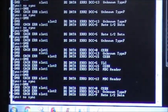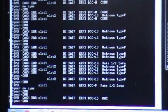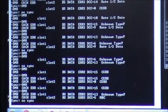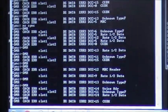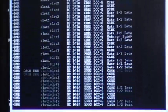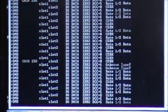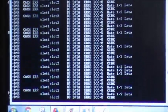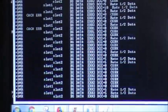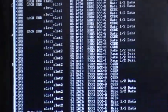Right now this is just audio from the external speaker feeding the computer, and you will notice all the errors coming up. And now this is audio from the discriminator tap — this is raw audio from the onboard chip pin 9 — and you can see a big difference in what's being sent here.